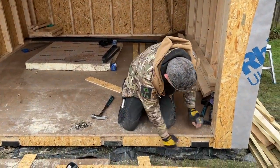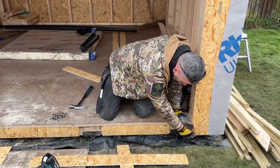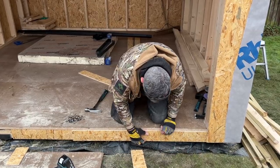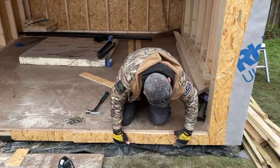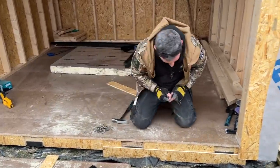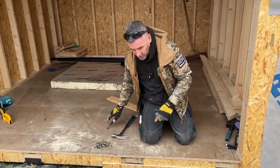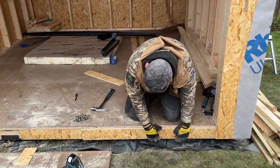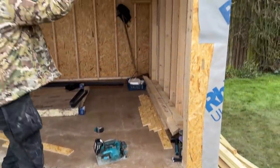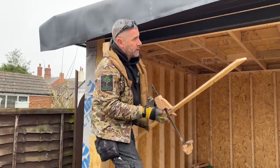We want to pack out the bottom here so it's in line with this — it serves no purpose apart from the fact it wants the slate battens, which will then carry the cladding at the end of the day, to run flush with there. So what we've done is dropped in some OSB there in between the shoes. Obviously you can't nail between the shoes — we'll pop another piece in like that, that'll get nailed, and then that will be flush all the way across. What you might want to do is mark up where your shoes are going so you ain't going to be nailing the shoe — especially if using a nail gun, because the nail will turn around and come straight out.